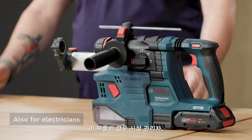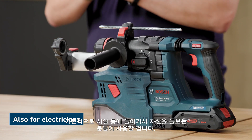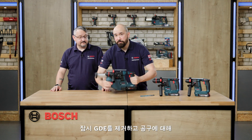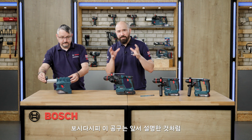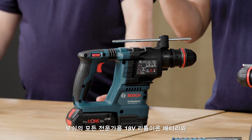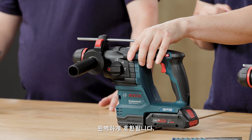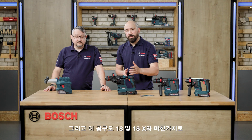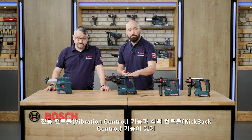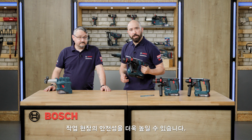This is excellent. We want to try and minimise the amount of silica dust, because it's bad for your health and also pretty messy. The key users we expect to use this will probably be working in people's houses. For this product, you're looking at facilities managers — basically people going in and looking after people's property. This machine is currently using a ProCORE 18V 4Ah battery, but it's fully compatible with the entire range of professional 18V lithium-ion batteries. Like the 18 and 18X, it features vibration control as well as kickback control for added protection on the job site.